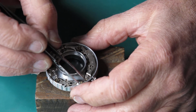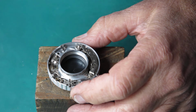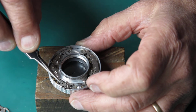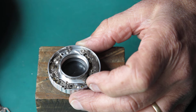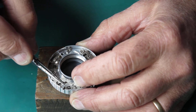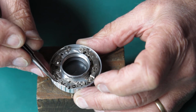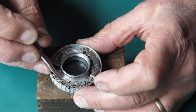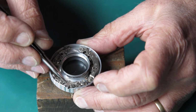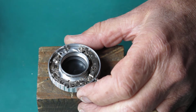2 brass standoffs go there and there. Our cover plate goes here. I have to get that hooked underneath the edge of the slot there. There's a slot in the case. I've got it hooked under there and over the posts. There's a post here and another post here, a pivot for that gear. And I've got that spring correctly positioned so that that pivot point post there holds the end of the spring. That this arm is sitting in here in this space, not trapped out here somewhere. That's all looking good.